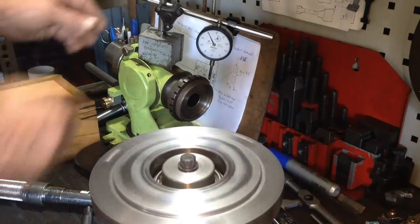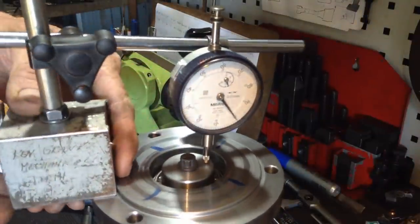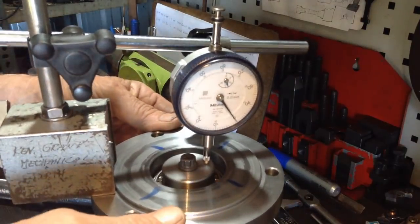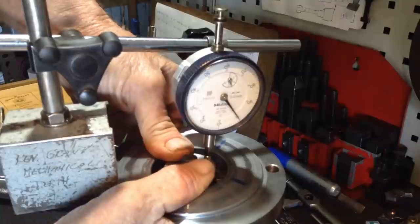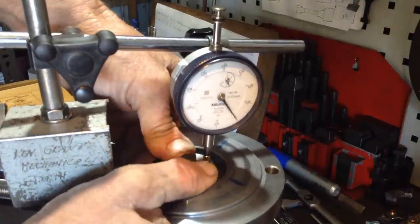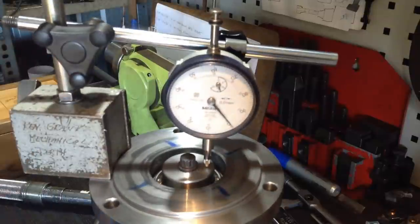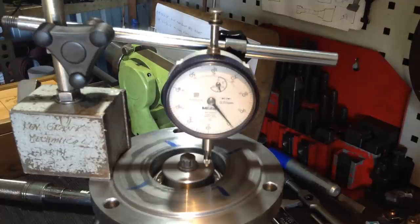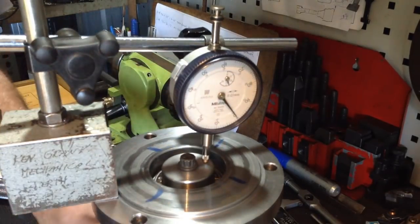And of course, Mr. Bozo here pressed stop instead of record when he did that, so let's do it again. So we had 0.02 before, I just took another whisker off and tensioned it down properly, so pushing down, pulling up, we got 0.01 millimetres there. I'm going to let that go because these bearings are packed with grease and I don't want this thing to run too hot. If it gives any trouble, I can always take a whisker more off. I can't put it back on without making another spacer. So I'm confident that 0.01 millimeter end float, I think will be fine.